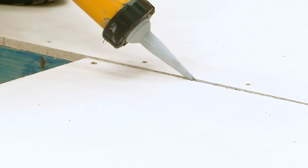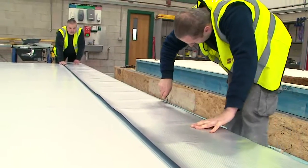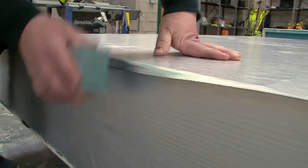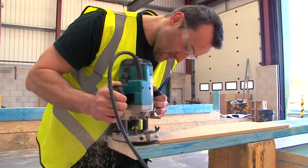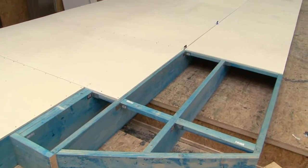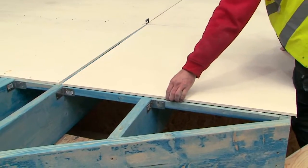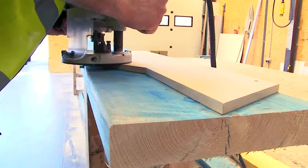The application of a self-adhesive vapour barrier further prevents air leakage whilst maintaining exceptionally high levels of vapour resistance. The flexibility of the InSolShell design enables the panels to be detailed in an almost limitless fashion, and use of such advanced materials allows InSolShell to be considered for use as full-height panels, limited solely by aesthetics and some structural design.